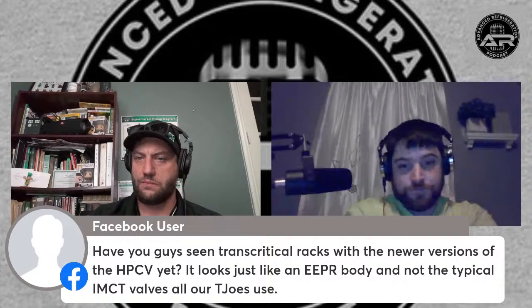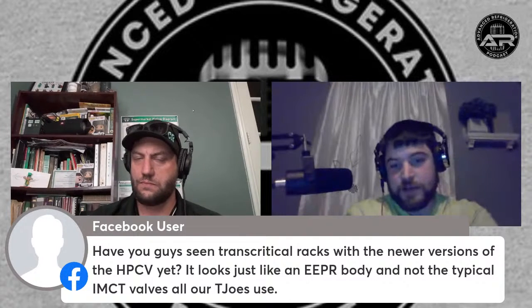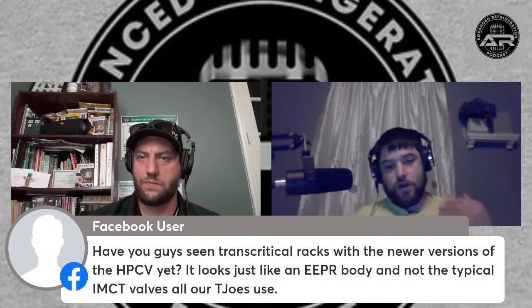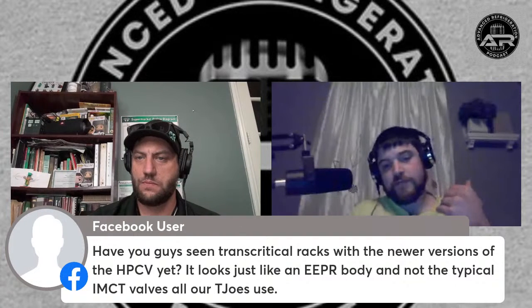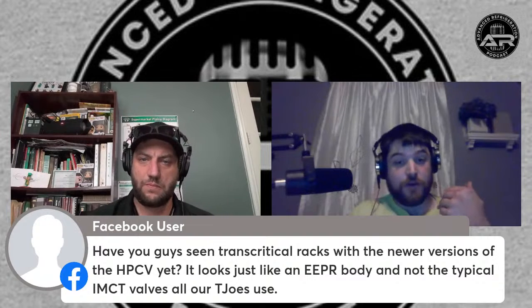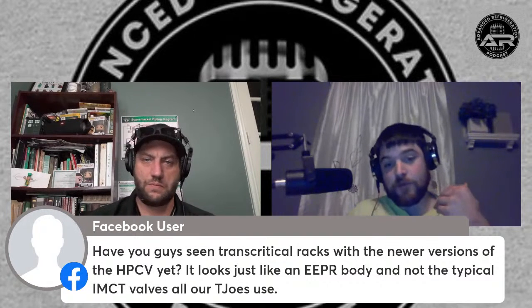I mean, that high pressure magnetic driver, I guess, was really expensive, and so with this, it allows you to get the high pressure valve smaller. So the smaller you get the valve, the less open it's going to be, so the less hunting you have. So the more properly sized the porting in those valves is really important. The more properly sized the porting is, the better the high pressure valve is going to run.